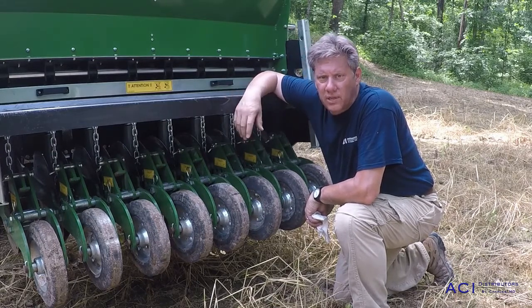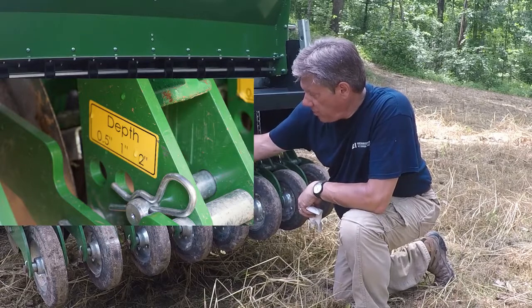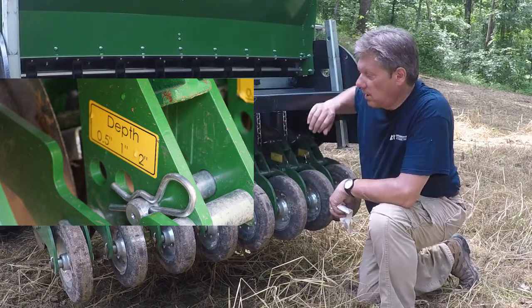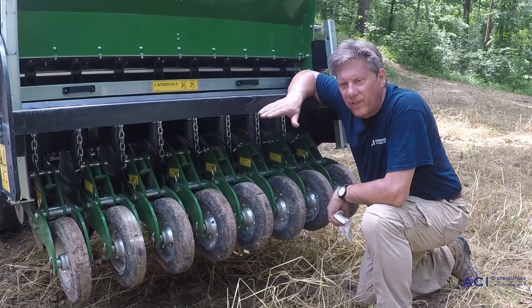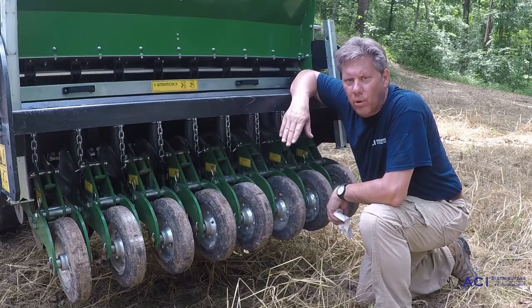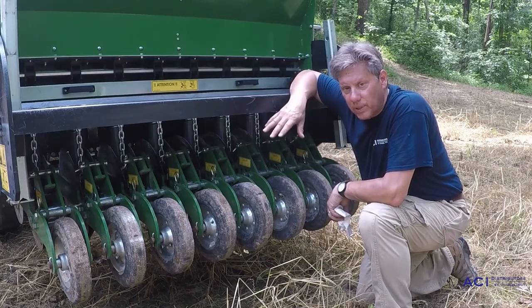We have two primary settings for depth control. On the back of the machine, your press wheels, there's a pin with three holes for different depth settings. There's a sticker that says half inch, one inch, two inch. These are just guides — they do not mean that's how deep you're going to go. Every field, every ground, every soil, and bit of moisture all makes a determination of how deep you're going. So your drill needs to be set up for that day, that field. Generally speaking, once you have it set up, you're pretty good to go.